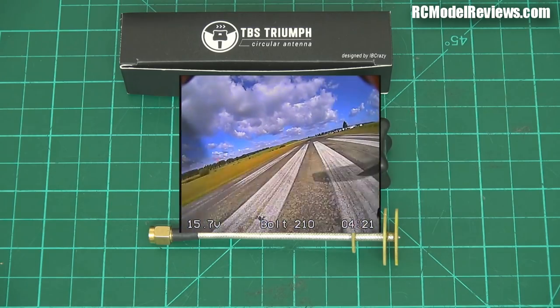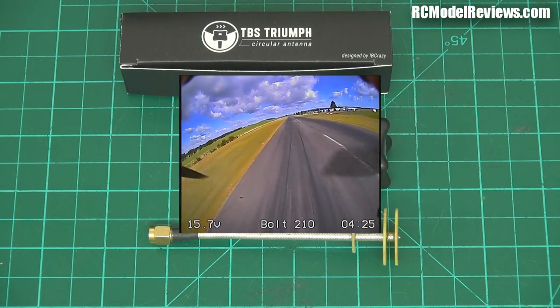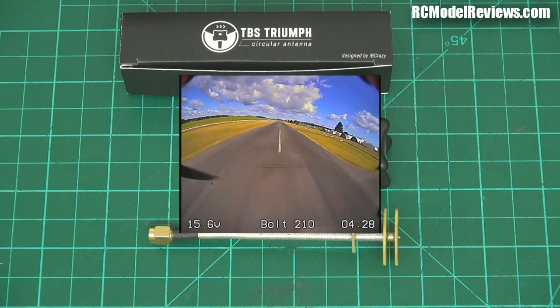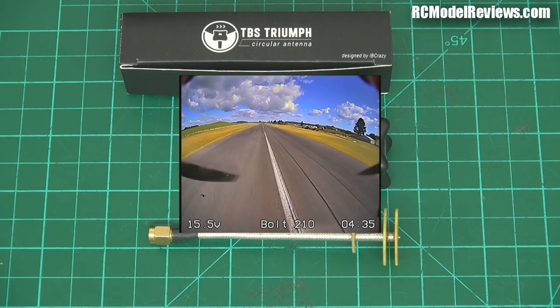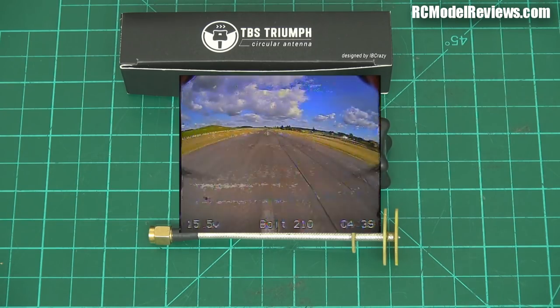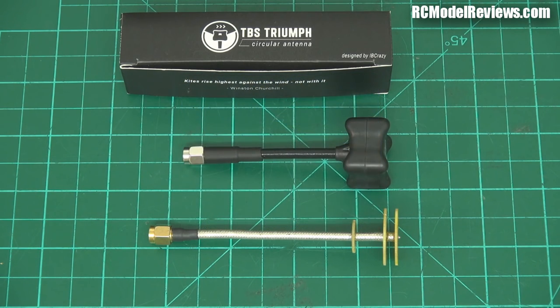I've taken a quad. Unfortunately I don't have the lovely environment that Joshua's got to test in. I only have a crappy old runway which doesn't offer many challenges for an FPV signal, so I've tried to get around that by flying low, by flying a long way away — 500 meters — by pirouetting to make sure the radiation pattern is nice and circular, and by flying directly overhead the receiver so that I'm lining up the null points of these antennas, trying to provoke them into giving a bad result.